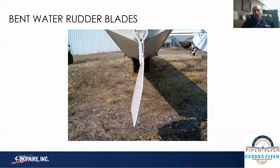This is some usage damage — it could also be from moving floats around, or severe steering under high power can cause the blades to bend like that. It's easy to spot: center the water rudders and step back behind the float, and you'll see any deflection in the blade that shouldn't be there. Also check that both blades have the same deflection left and right, because as cables stretch, you could get one blade toed in or out differently than the other, causing steering anomalies. These adjustments can be made during rigging when putting the floats back on.